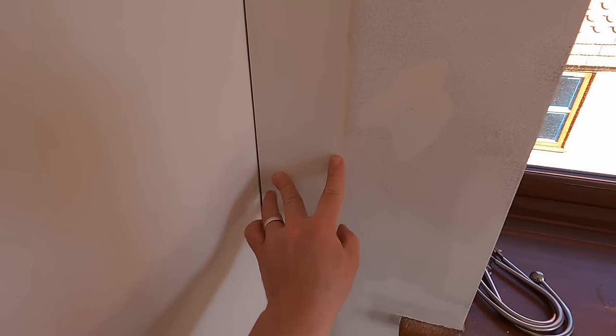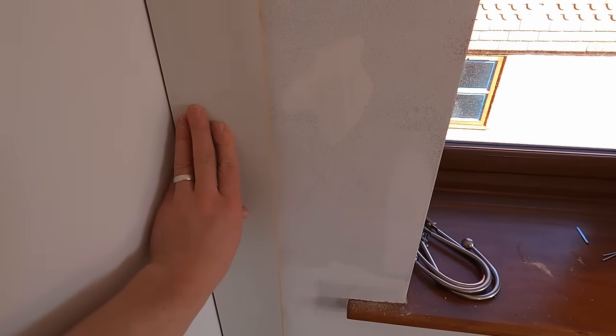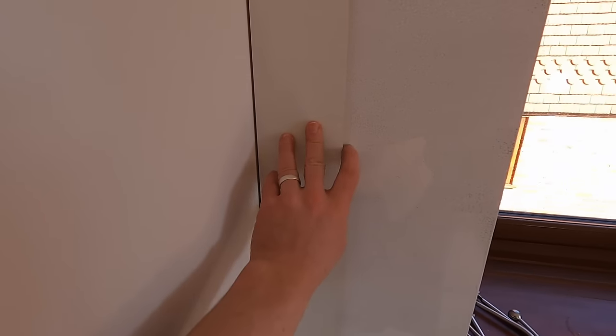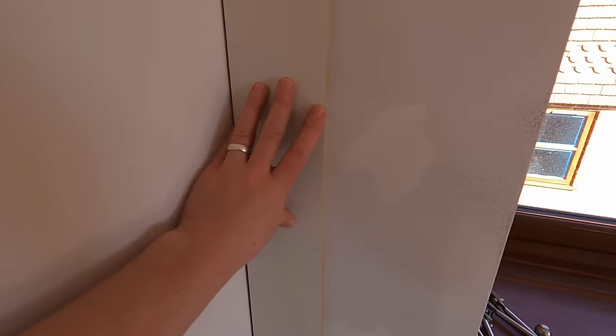As you can see there's a bit of discrepancy in the wall. Now the big question is: do you plumb this up and fill in the gaps, or do you push it tight? What I'm going to do is use the level, plumb it up, and do it that way, then fill in the edges — because that looks like there's a serious bow in that wall. So I get it straight, hit it in, and then we'll have to just fill that edge there. The previous walls obviously weren't straight. That'll be a filling job after. Nail that in and carry on.